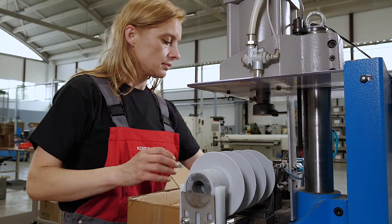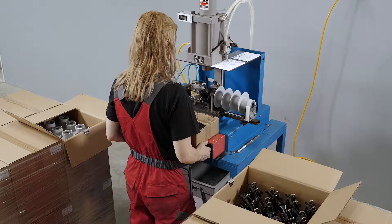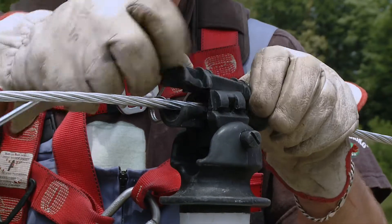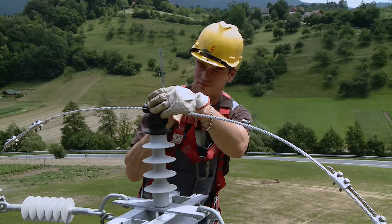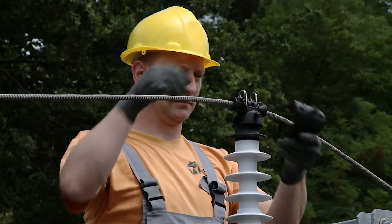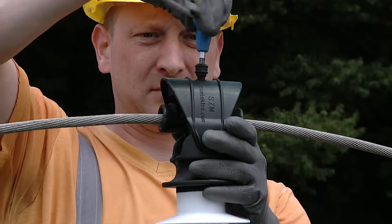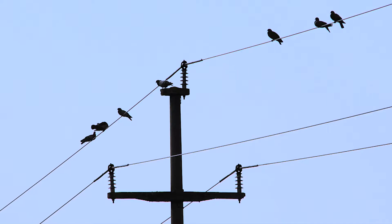By adding various parts to the spring clamp, the vertical and horizontal pullout force can be increased. The fitted spring clamp with the appropriate cover provides factory-set vertical and horizontal pullout force. A pivoting spring clamp or tension clamp is mounted on the top end fitting made from insulating material. The screw clamp with a cap and silicone coat on either end of the clamp can be used as protection for birds.